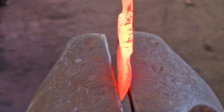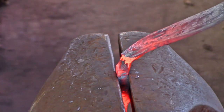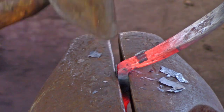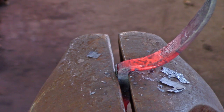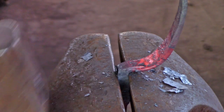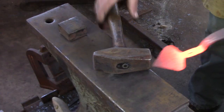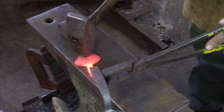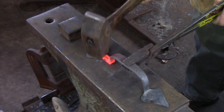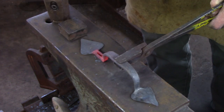For the other cusp, clamp the mortise at least the thickness of the bottom of the handle up in the vise. Bend away to not quite horizontal, and then true up the corner. Once you've got the corner where you like it, lift up on the stock and put your bend in with the cross peen. You might find you have to go to the bic to dress one end of the handle or the other to make them equal. Make sure everything is laying in the same plane by working on the flat face of the anvil. Use an anvil block or the edge of the anvil for truing up the cusps. You may need to run your drift through the mortise hole one more time, but that's the handle complete.